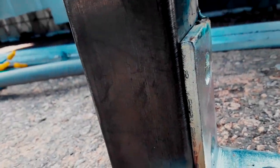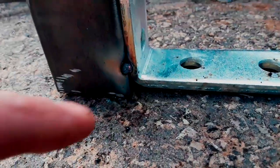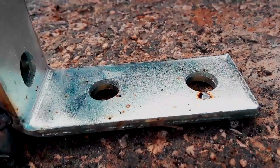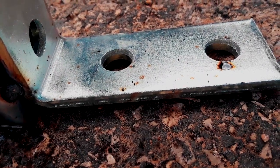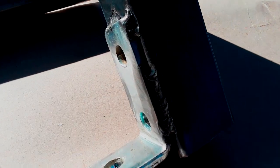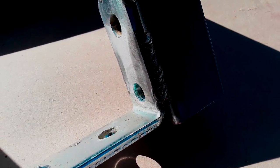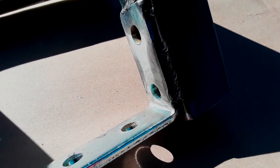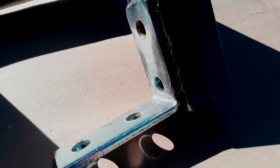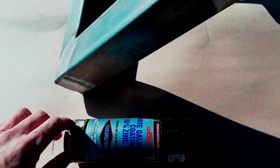I mocked it up to make sure where I was going to weld it, so the ground wasn't causing it to go out of level when I went to weld it to the guide post - but we're good. The stand's built - just a couple tack welds on top and a long bead down the side. You don't have to go all the way; that's probably more than enough. It's not going to have that much stress in that plane of the weld. I've got some bright galvanized coating, 65% zinc rich, so we're going to spray paint this now.